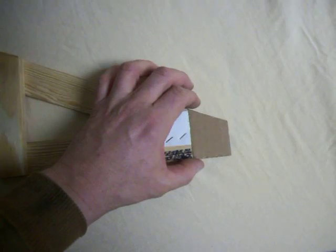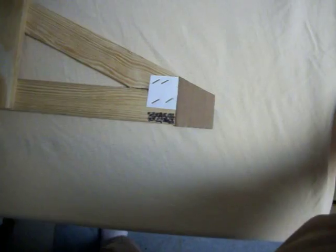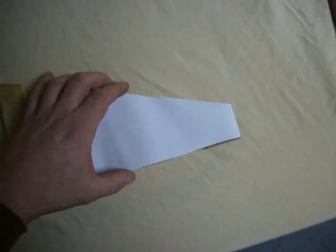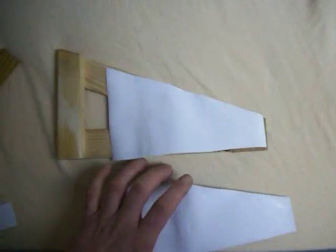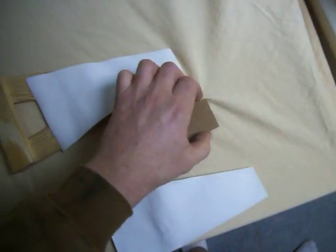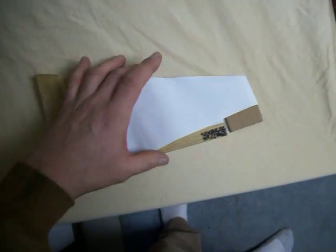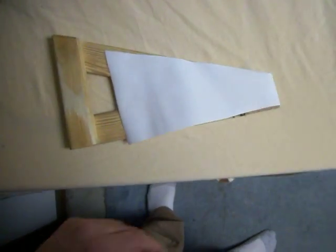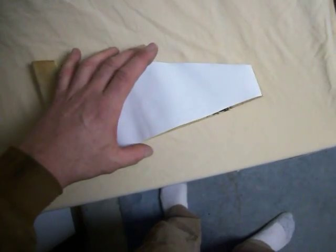So we need that little piece, but this is structurally not going to do anything unless we hold it in place somehow. My proposal is that I cut some half-inch sheets of plywood to act as gussets. So we screw or nail this into place, and then I have a gusset on the back side. These two things will be sandwiched in this gusset - big plywood sheets of gussets. And that should support the roof and make these two pieces structurally sound.